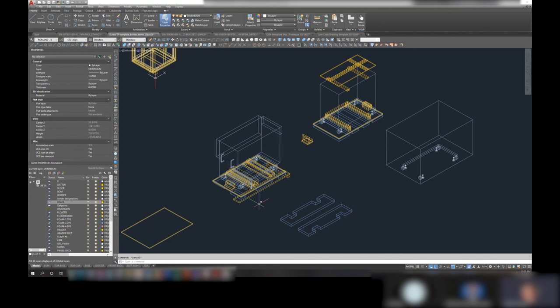For that we need the purchaser to go and check for us, because sometimes the purchaser keys in wrongly. Many times square feet become linear feet, and linear feet become square feet, so all the materials become haywire. Some become very cheap, some very expensive. One linear foot at 30 ringgit? What type of rock are you selling? One inch of length at 30 ringgit in material cost? Wrong. They keyed in the wrong UOM, unit of measurement. From day to day, we will learn where these go wrong.